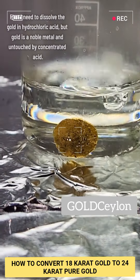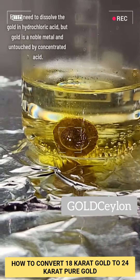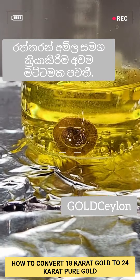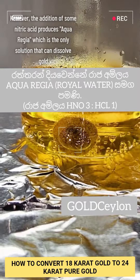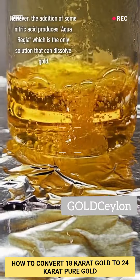The silver can only be removed chemically, and to do that I need to dissolve the piece in acid. The only problem is gold is really chemically resistant and impervious to all acids, and the only way to dissolve it is by mixing hydrochloric acid with a bit of nitric acid. This produces a solution called aqua regia, which is able to dissolve the gold in a two-step reaction.